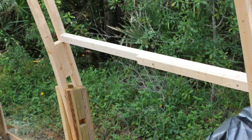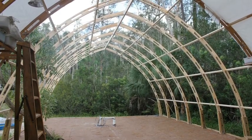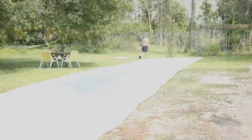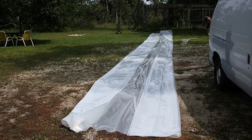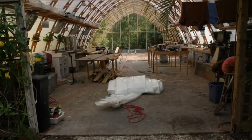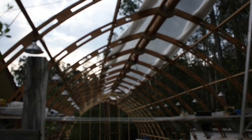The last part of this project was taking the old 6-mil poly skin off my existing greenhouse and then rolling out a new piece that's 75 feet long by 40 feet in the yard. Because of the way it's rolled when you get it, you have to totally unroll it, then roll both edges in towards the center. Once it's rolled up that way, you tie it together to cinch it up and roll it lengthwise into a bundle that you can hoist up onto the roof. As it goes up onto the roof, you untie the bindings and it deploys and rolls itself out over the greenhouse. You've got to do this on a calm day — first thing in the morning — because it can turn into a nightmare if the wind picks up. It takes about an hour. Once it's all unrolled, you just staple it down. That pretty much finishes the project.